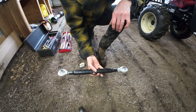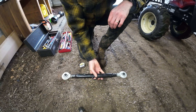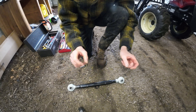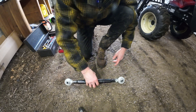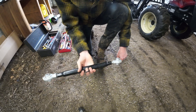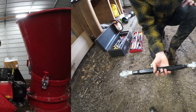You could try to match that range, but it's probably better to look at what your implement is sitting at when it's normally set up. Find the range it uses and try to hit the middle of that range when you order your top link, so you've got the best latitude to work within what your implements are actually using. This is still useful - I can still use it when I'm either using the second remote or have a fixed link that I need.